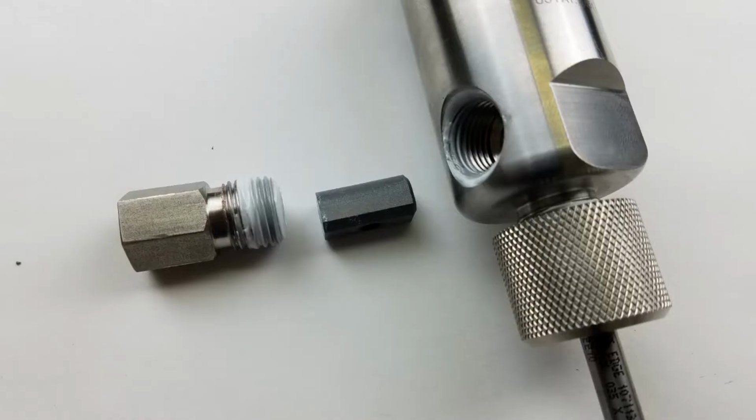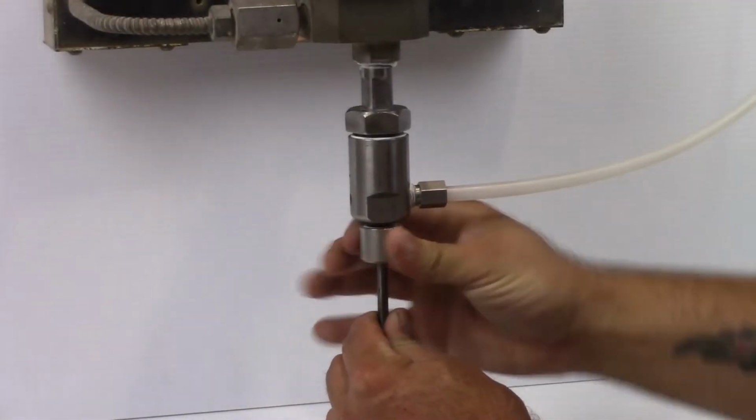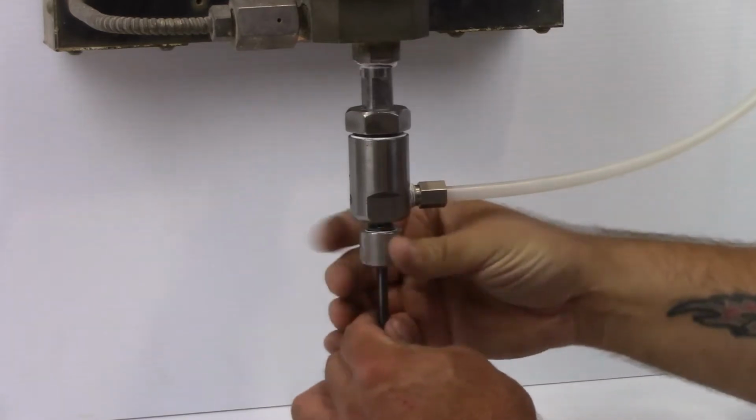Another component that will need to be checked periodically will be the mixing chamber. The mixing chamber is used to extend the life of the abrasive body. It is used for the initial mixing of abrasive and ultra-high pressure water. This may need to be removed to clean the cavity of clogs of wet abrasive and to change when the bore wears. Remove the nozzle prior to service.